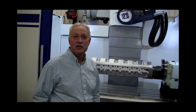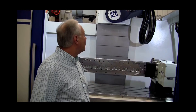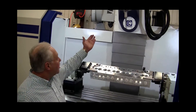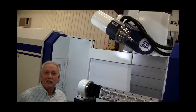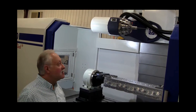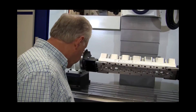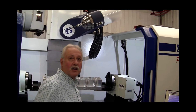We've got an exciting new machining center here this year. We've been holding out, but we gotta let the cat out of the bag. This is such an exciting new machine — we have a 40 horsepower spindle, an articulated head that goes plus or minus 90 degrees, we've upped the game on our tool changer going from 24 to 40 tools, we have a chip conveyor, and through-the-spindle coolant.